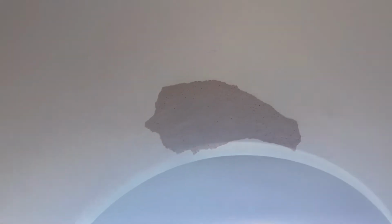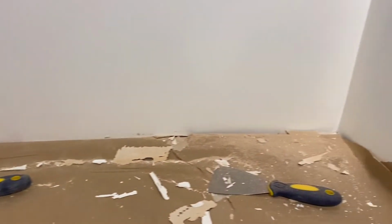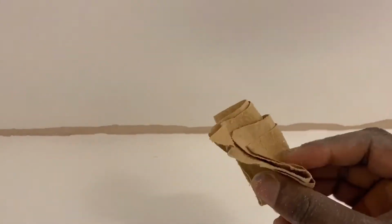Okay. The next step would be to patch the plaster wall in the bathroom. When you take your bath, steam sometimes soaks into the paint, regardless of whether you're using an extractor in the bathroom. This happens over a protracted period of time. So I've pretty much scraped out the flaky paint, and sandpapered the trim edges down till they become smooth, so that it's not apparent when I paint over.